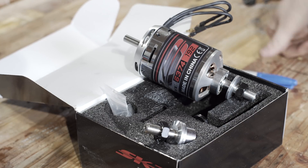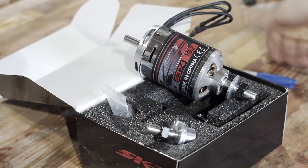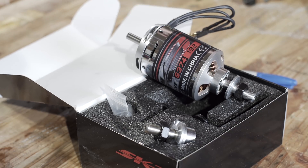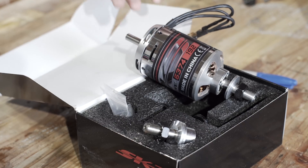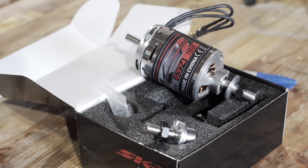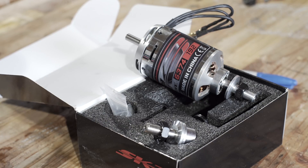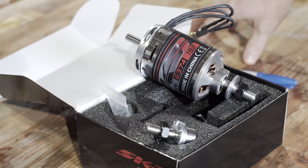I'm hoping to cover anywhere from about 200–300 RPM up to about 3,000–4,000 RPM. The nice thing about brushless is that unlike a VFD drive on a normal induction motor, as you reduce the speed you don't lose torque. So this should be pretty torquey even down at 50–60 RPM. As long as it has enough RPM to keep spinning without cogging too heavily, it's not nearly as big an issue as with an induction drive.